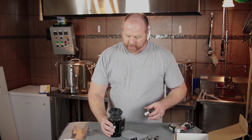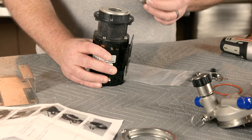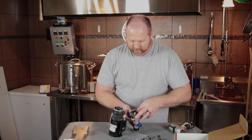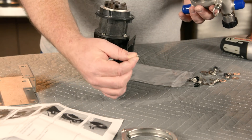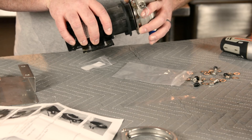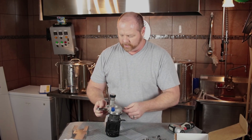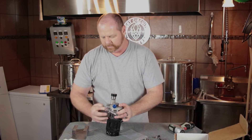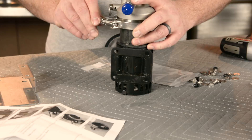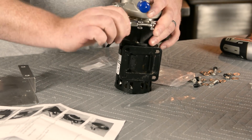From there it's pretty simple. Put the impeller housing in there, then the impeller. There's an o-ring that goes down inside of the body of the unit, and a small thrust washer — make sure you don't lose that. Put it all together and grab the tri-clamp. I could unscrew this quite a ways in order to get it to work on there. Put that on, turn it to a good orientation so it doesn't interfere with anything, and tighten it up.